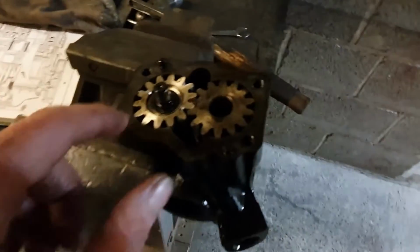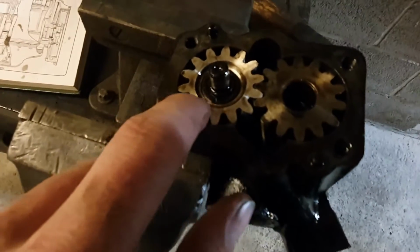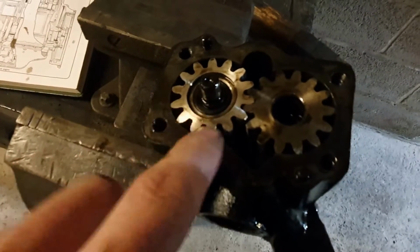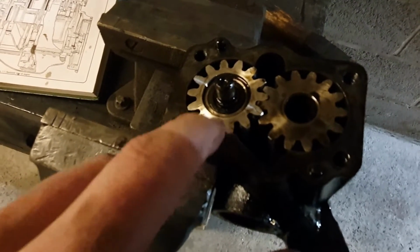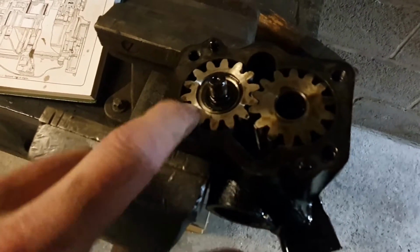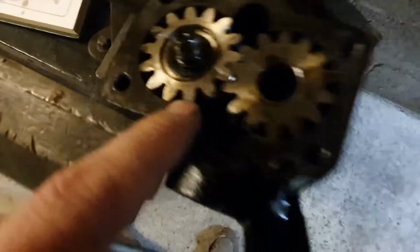And then there's a radial clearance between the tip of the tooth and the casing. And the aluminium one, I can't get the very tight feeler gauge in there at all. So because it's supported by this shaft, the aluminium has not been free to touch the casing, so it hasn't worn at all. So it's like brand new in terms of that. I can't get the smallest feeler gauge in there and close that tooth in on the casing. But this one, well, this one's a very different story.